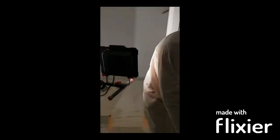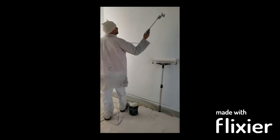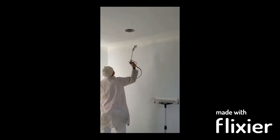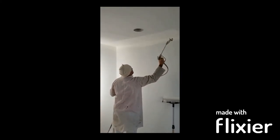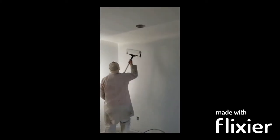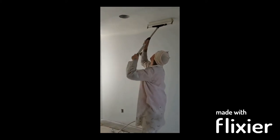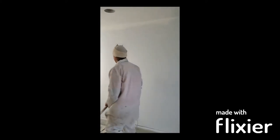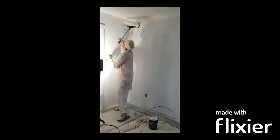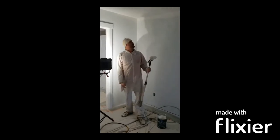So I'm going to give you an example of the ceilings - what color it is. We're going to go with Swiss coffee; it's very common in Chico to use that. I should use my mask but for this demonstration we're going to hold off. Okay, we're just going to go slow, 50% overlap. Then with our roller - roll it up, make sure it looks good. Obviously we're going to do more of an area than this. When you're back rolling, you want to stay away from this wall because if you go too close you'll scratch the wall and mess up the texture.